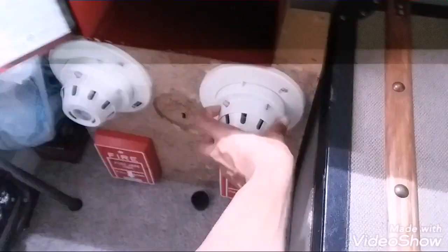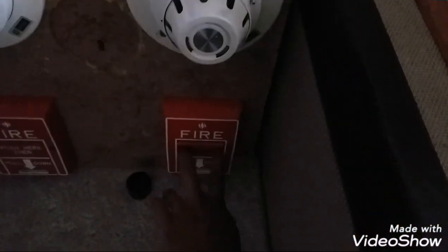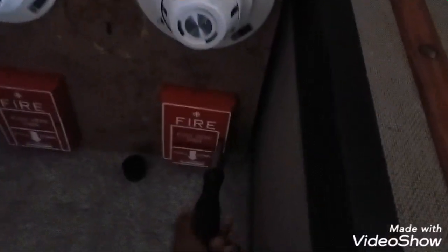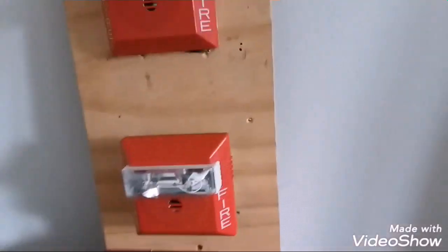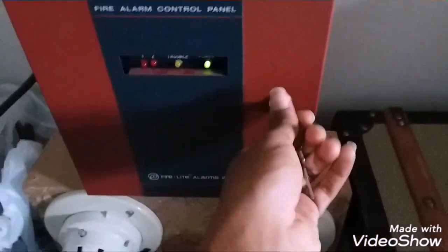There she goes — and let's go ahead and reset the system. Now if I keep that switch on and just activate it, it will ring briefly but then silence, because the Wheelock synchronization protocol takes a little bit longer to silence the horns. The rhythm change of the sync module gives us our audible silence — and that was zone one. Let's call that a test and call it a day.